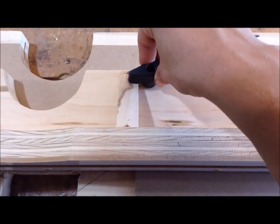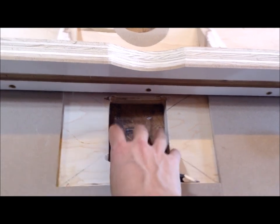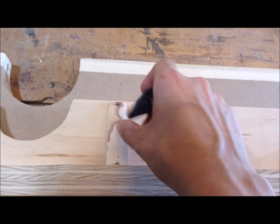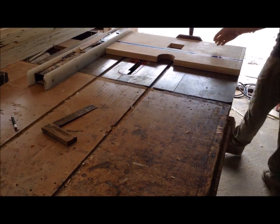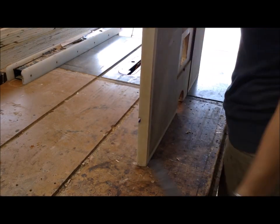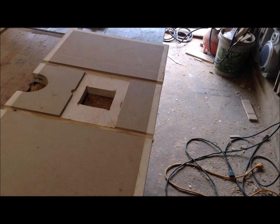Because I already glued my angles in place, I wouldn't be able to turn my knobs if I added T-track right there. However, I do like having the two sides be metal — it reduces the chances of wood swelling and making the insert hard to take in and out. So I'll follow the book's layout but put a spacer on the back so I can spin my knobs. With the dado already set up, adding the remaining T-track is the same process: cut a dado, trim the track to fit, and screw it in place. Because the table wasn't symmetrical, I had to adjust the fence and do the second side separately.